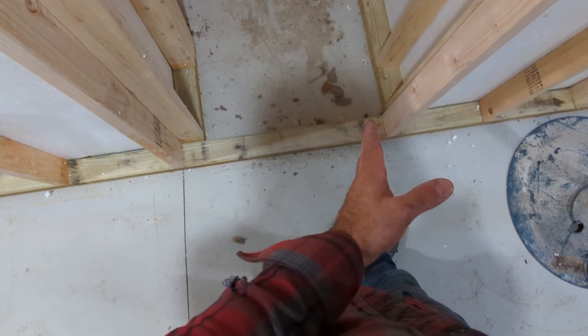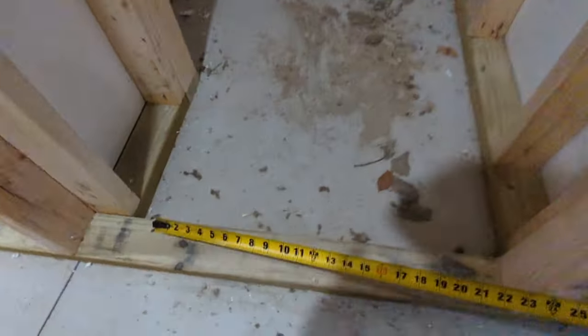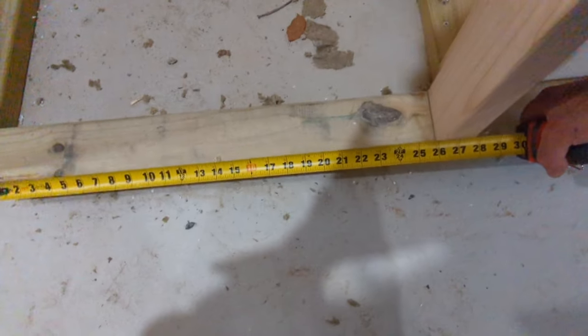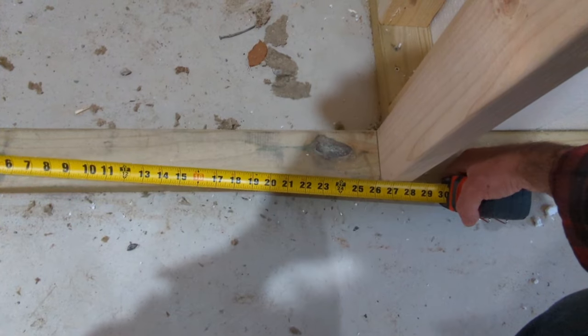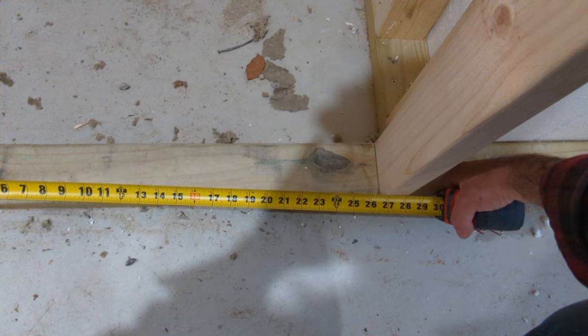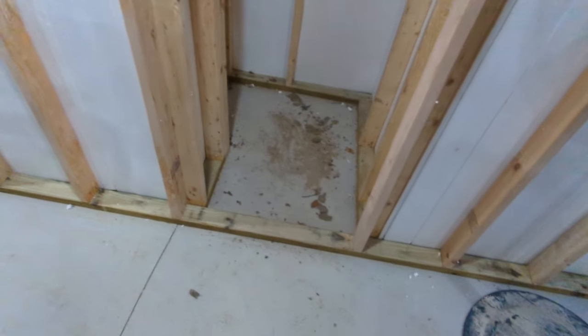That's a good question. I got to look at that. I can get a 24-inch door slab, but of course that's a 26-inch rough opening, which, what does that look like here? 26 is like to there. That's not really enough, because you can trim the outside, but you can't trim the inside, which is kind of a bitch. But I hate the idea of a 22-inch door. I'll have to go and look at one or find one.